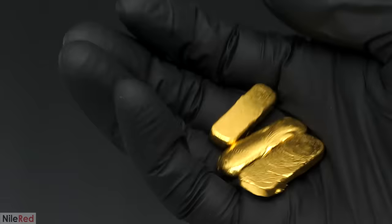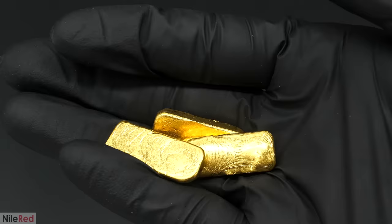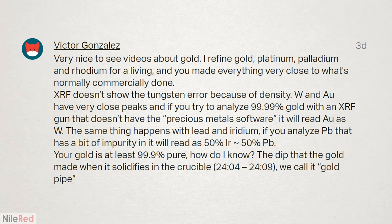As one final thing after all this, I went to a company called Kitco and I had them test the purity of both the gold and the silver. They initially told me that they were both 100%, but they didn't know that I wanted a printout of the results. So I had them run it again, but this time the results were slightly different. The silver was still 100%, but it said that the gold was 99%, and the rest was tungsten. However, I think this was just an error, because if I got out 100% of the copper and silver, there's no way there would still randomly be 1% of tungsten in there. When I posted this to Patreon a few days ago, one of my patrons, Victor, gave a good explanation as to why it might have told me there was tungsten. The gold was tested by something called X-ray fluorescence, or XRF, and he said that sometimes it can get confused between gold and tungsten, because with XRF the tungsten and gold peaks are very similar.